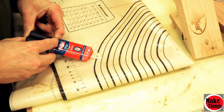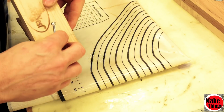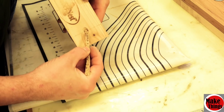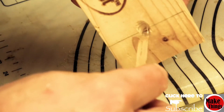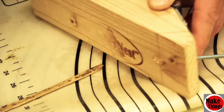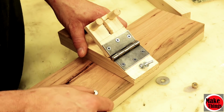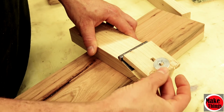With the epoxy, I permanently glued in the bolt, which will keep it from spinning as we tighten down. Now originally, I did use some extra washers, but only because of the width of the cut I made with my bandsaw. I'll touch more on that later.